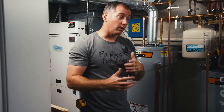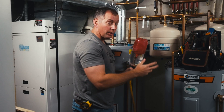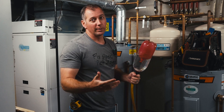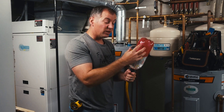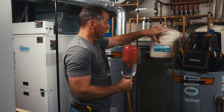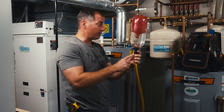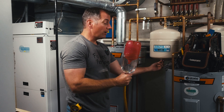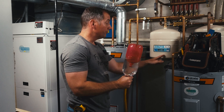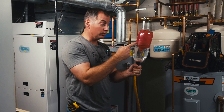Let me give you a quick visual on what an expansion tank does and what it does in relation to pressure. It's all steel normally and you don't really know what's going on inside. I've made a clear version so you can see inside — it's a big bladder tank connected to a water source. On the bottom there's an air Schrader valve connected to a big rubber balloon inside the tank.